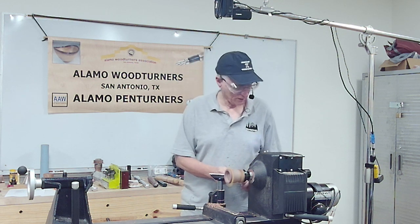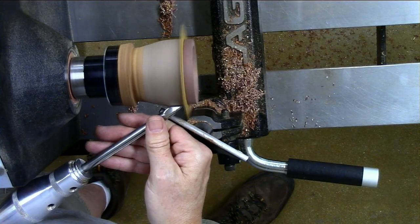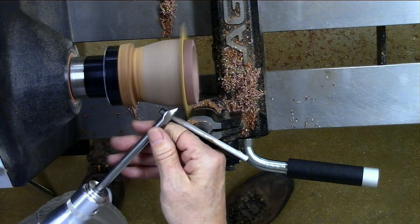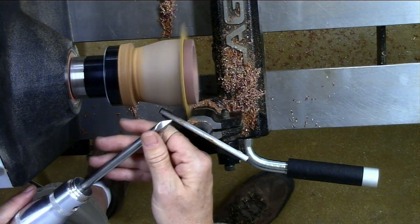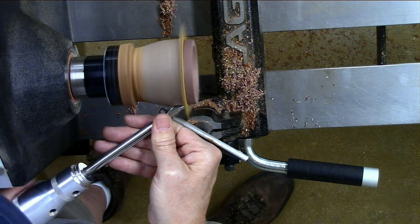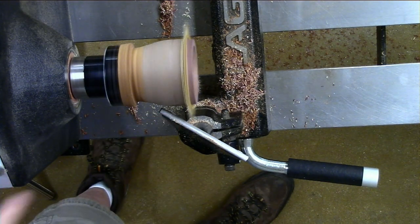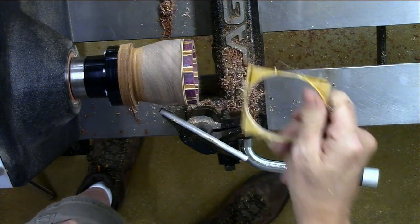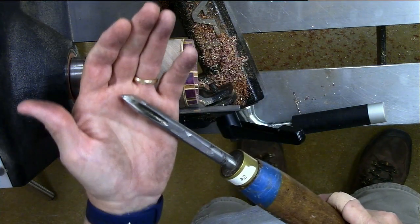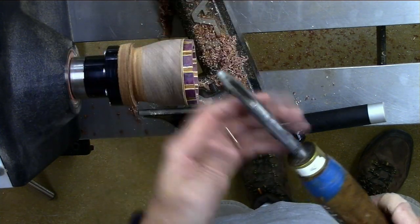The last step in stage 2 is to trim off the veneer. Use a sharp tool to avoid tearing out the fibers in the veneer layers that might leave gaps. I'm using a detail bowl gouge for this. Now I'm going to use a bowl gouge to do shaping of the assembly of the lower body and the feature ring.